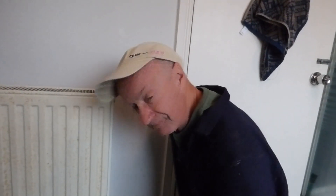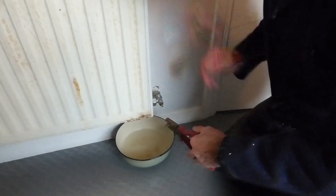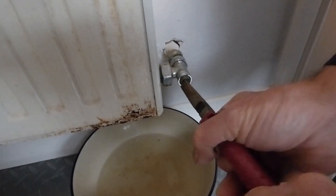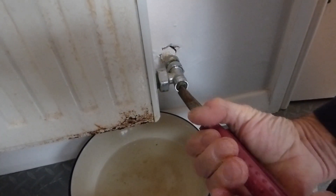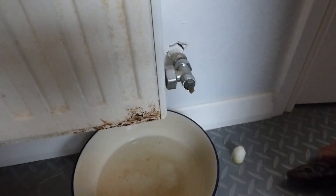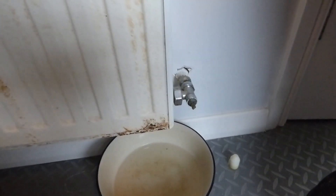I'll use a pair of pliers — I'll show you now. This particular radiator has got the boiler right next door so it's only on half a turn. That's probably all it needs because the boiler is in the cupboard right next door — we don't want it robbing all the other radiators. That radiator is now isolated. We're going to open the air screw, let the air in, and undo one of these valves to get the water out of the radiator.